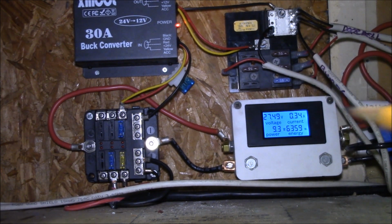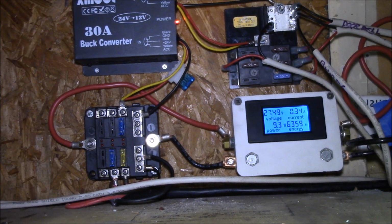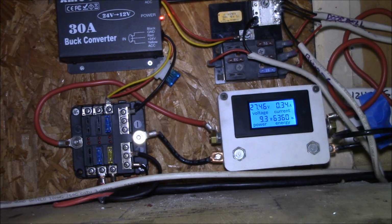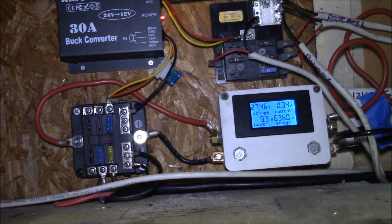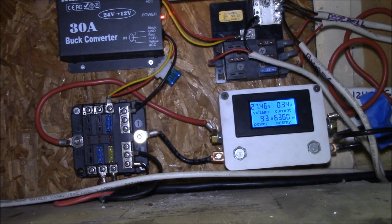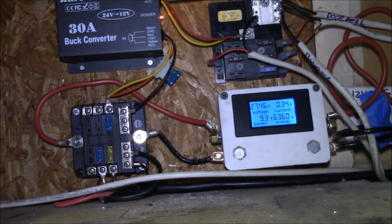You had to reboot it. I did it one week with the freezer only, and that used 330 watt hours per day, or 1/3 of a kilowatt hour per day. I got the 12 volt step down converter running on New Year's Eve, and we were at about 4,800 watt hours. So now we've put on about 1,500 watt hours in 3 days. So yeah, running about a half a kilowatt hour a day out here, mainly the freezer and then running some of the lights and whatnot.